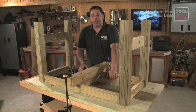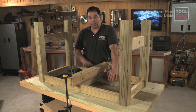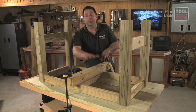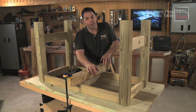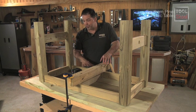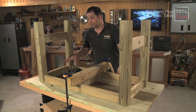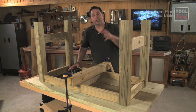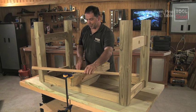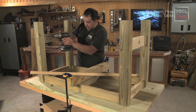At this stage, I've taken all the tabletop pieces, turned them upside down on the workbench, placed the base of the table on top, and used a 4x4 and a couple of clamps to hold it all together — that's a technical term. We need to attach all of the boards to the apron with our pocket holes and screws, so it's a good time to make sure all the pocket holes are in the right place. Also, for those wondering how we get the footrest dowel in place — this is that step. I've taken all but one screw out of this part of the stretcher.